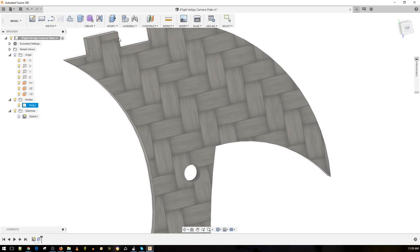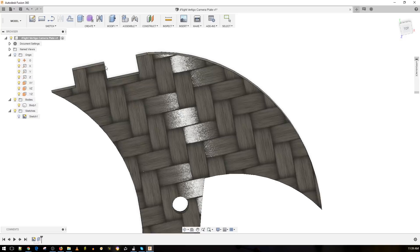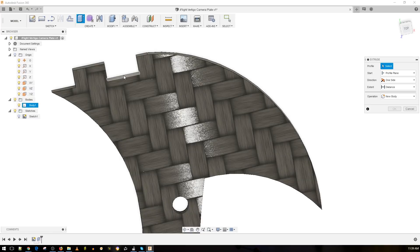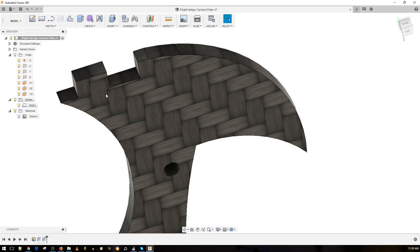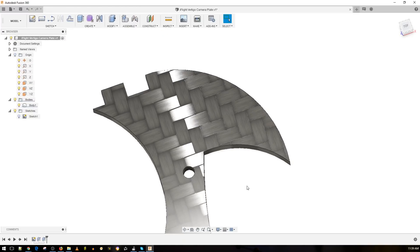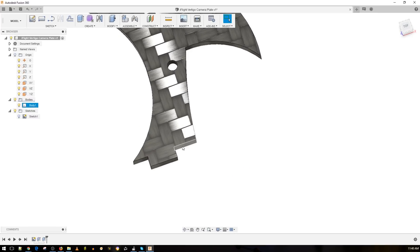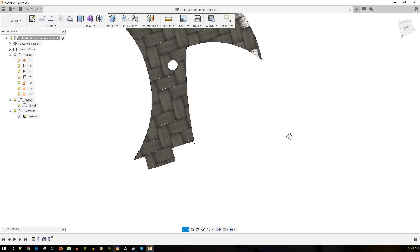There's something important to take note of when putting this together: these sharp corners are not going to be sharp on the actual cut — they're going to be rounded. So when you go to put it in, you'll find it won't fit because there's a little extra chunk of carbon fiber left over. What you want to do is push this down a little bit more. I'm going negative 0.5 millimeters — just 0.5 of a millimeter — hopefully that'll give me the extra room I need to put it in. You can also just file it down. I'll go ahead and bring it up 0.5 and make that a negative.